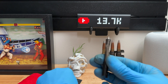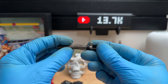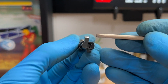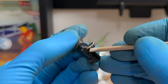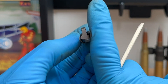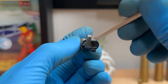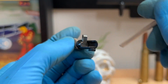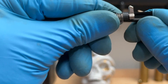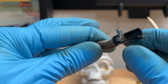Take it out of the slide — there we go, it is installed correctly. As you're installing everything, things may move around a little down here. Make sure it looks like this: the long part is facing up, this part right here is facing to the left, and the part inside is against this area of the sleeve. If you compress it, it moves smoothly and doesn't feel weird. Now that we have the striker assembly put back together, I'm going to change the camera angle to finish putting everything else back together.